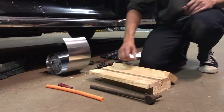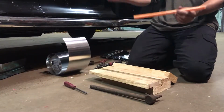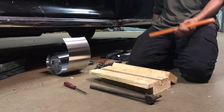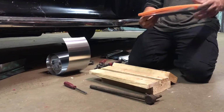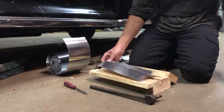So I'm putting radiant heat flooring in my cabin. We use this PEX tube, runs a pattern through the floor, run the hot water through, which will heat the cabin. So this will run through some styrofoam insulation, but we use these heat transfer plates that this runs inside to deflect the heat upward into the cabin.